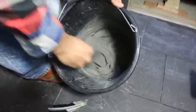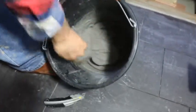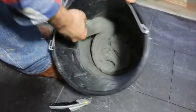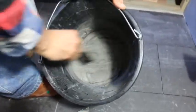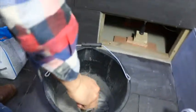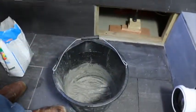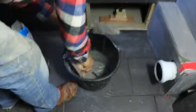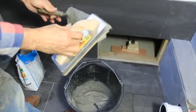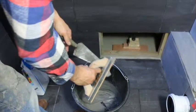Same as mixing tile adhesive, we're going to mix it until there's not much shine on it — it's going slightly dull, slightly matte if you like — and it's hanging on the trowel. This is a grout float for grouting, and it's hanging on the trowel as you can see, so we know it's not going to be all over the floor once we're picking it up out of the bucket and putting it in the joints.